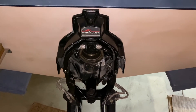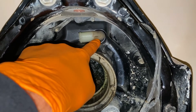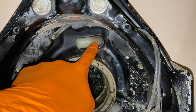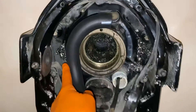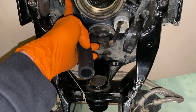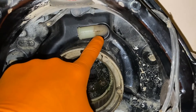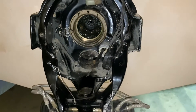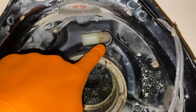We've transitioned to the garage where the boat is. Here is our transom where the outdrive connects into the bell housing. The water tube I've been mentioning is right there — ours is plastic and it feeds into a rubber bushing and goes to the internal portion of the hull, connecting to an additional rubber hose which feeds all the way up to the top portion of the inboard engine into its housing. The three-quarters inch hose connects and loops around the gimbal bearing housing and feeds outward where it connects to the bell housing fitting — each end secured by those clamps. I want to talk about the inner bushing. In my opinion, it is extremely important to replace that bushing during this stage of the project. If you replace your outdrive, rebuild it, install all brand new hoses and bellows, and then launch the boat and still have a leak inside the hull — it may be that rubber fitting.